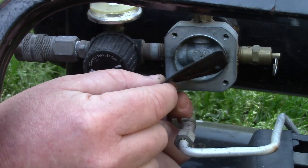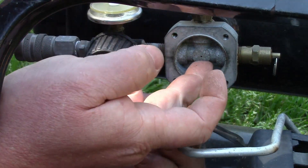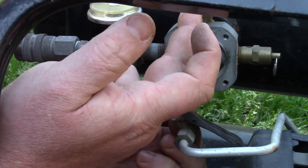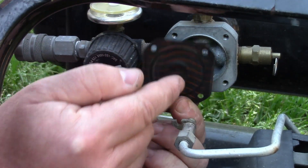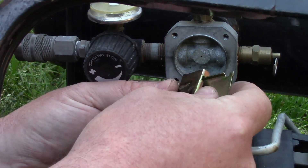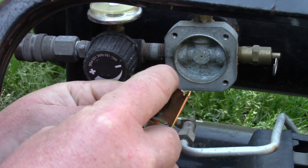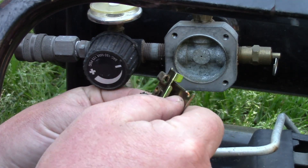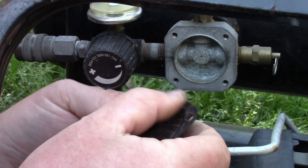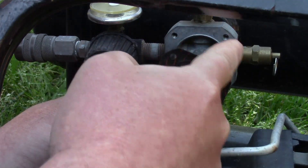This little diaphragm is in between the contact switches. So the pressure comes in from the tank, goes to the blow-off valve, to the output, and to... whatever that is. This thing swells up, pushes out, and makes contact on the back of this little lever — somehow moving it enough to break the connection with the contacts and turn the compressor off. And look at this — the diaphragm doesn't have any obvious holes in it. I might have been able to fix this just by tightening up those torque screws.